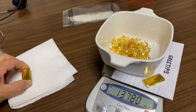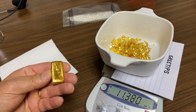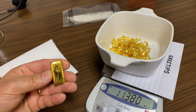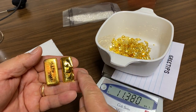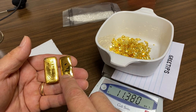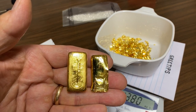Some folks will be asking why I did this — what was the point of all this? What I wanted to do was repurify the metal. Here's a little bar that I poured before I started. The gold was in this form when I started, and I took some of it and poured this bar. You see the surface there — it's got a little bit of a dull finish to it. Here's the bar that we poured just a few minutes ago, and you can see the difference in the surface of these two bars. This one's got some contamination — a little frosty spot right there, indicative of contamination of some sort — but this is probably very close to three nines fine here. You can tell visually the difference in purity between these two bars.